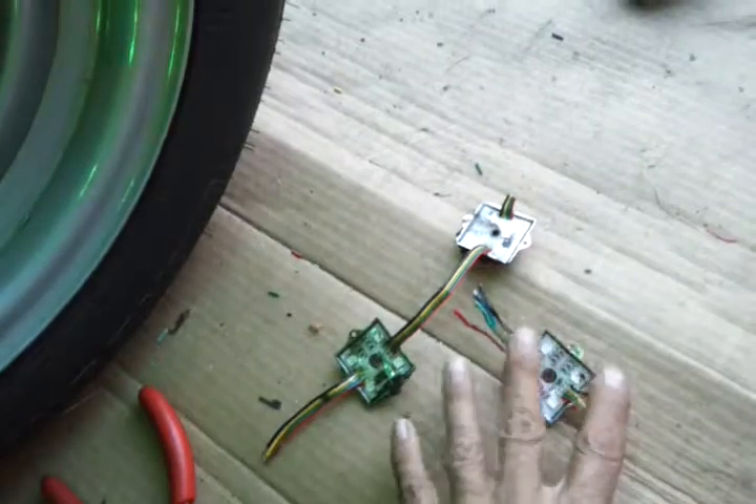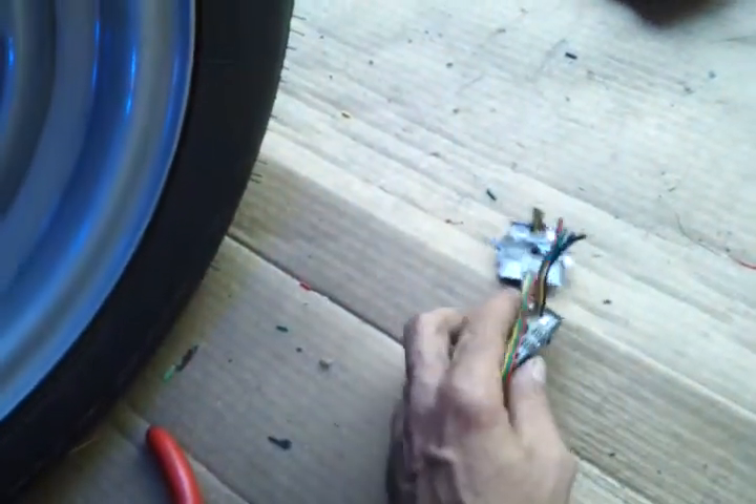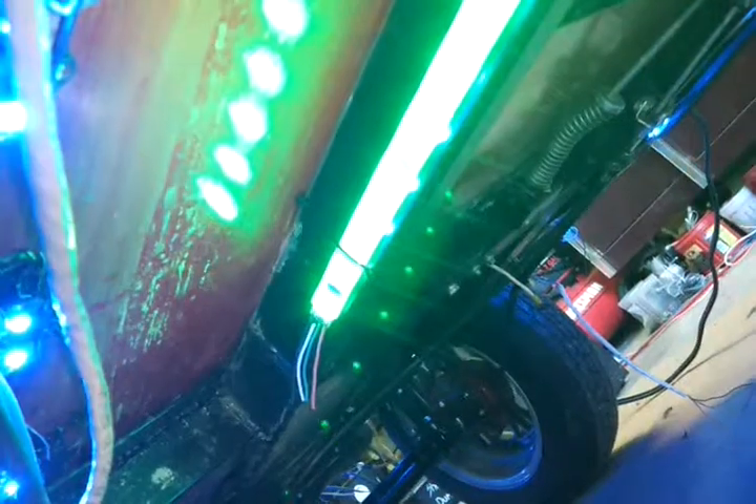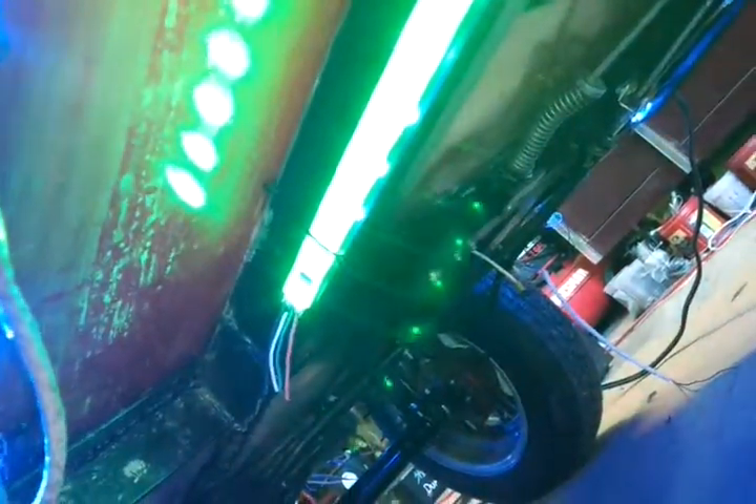These three pixel lights right here are the culprit for my undercarriage not working, and I need to replace them. If one of the chips fails, it's usually caused by a voltage issue — that affects the output of the chip, and you have to cut that chip out and put new chips in.